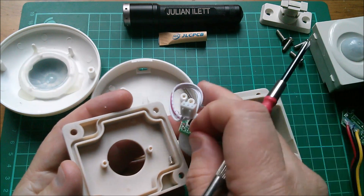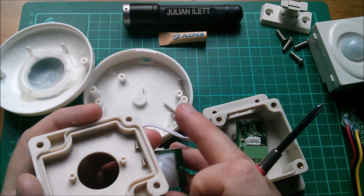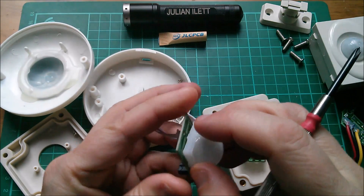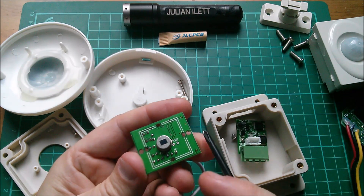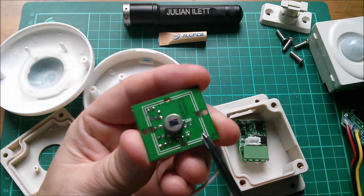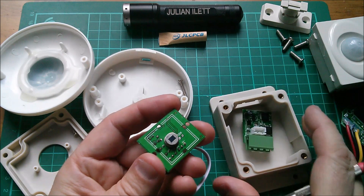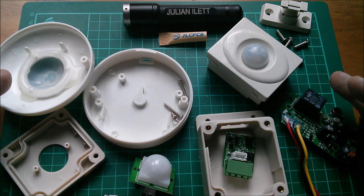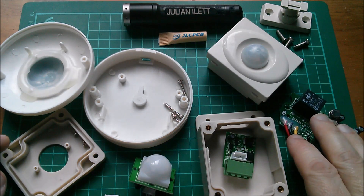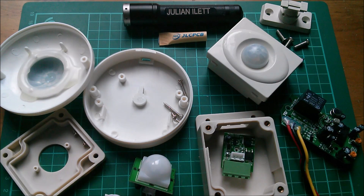This one which I can still buy new I'll put at the rear. I've got a feeling this one doesn't come standard with a CDS light-dependent resistor, but it's relatively easy to fit - those two unused pads are for the CDS. You can see 'CDS' written there with two unoccupied pads, so I'll need to fit a CDS - this one just doesn't seem to come with one. That's it for the moment. I just wanted to look at what was inside all these units, whether relay-based or MOSFET-based, whether they have the LDR or not, and which one I want to use where. Cheerio.